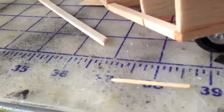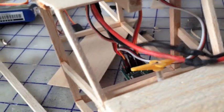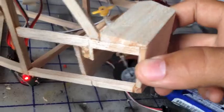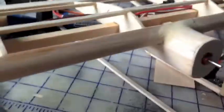Oh yeah, and I also have the front nose landing gear just tucked under there. It's turnable and it's connected to this control horn at the top. So it's sort of set up like that. So now I have to set up the rear landing gear, which is just going to be rollers. I figured I had to make something steerable on the landing gear just because these aren't differential thrust. I guess I can't do that with my tactic, but that's alright.